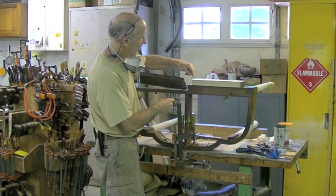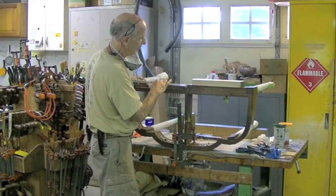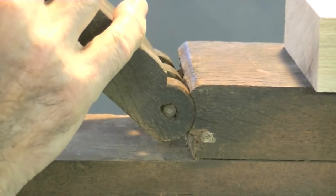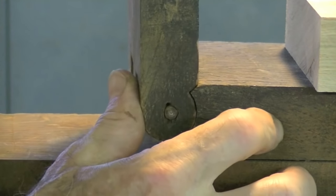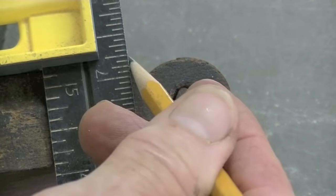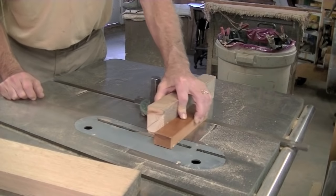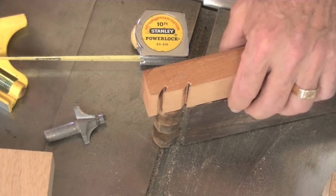So now this will be my first attempt at cutting this knuckle joint here. I'm looking at it and I realized there's a bevel cut here that actually serves as the stop where the other leg meets it right there. I think the first thing I'm going to do — I believe it's identical to this one, it almost has to be — I'm going to measure back and I'm going to make that little 45-degree cut. I think that cut looks just about right.